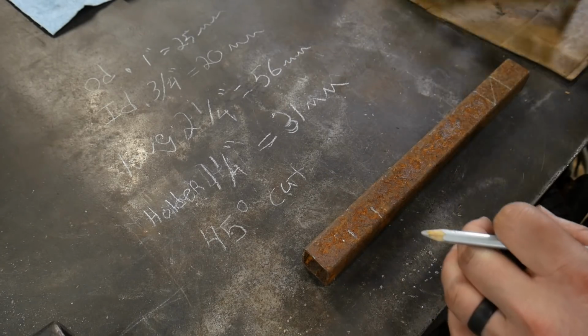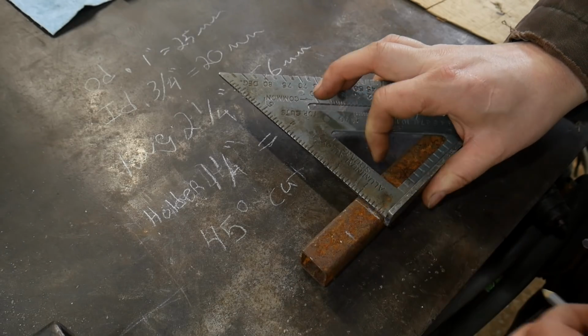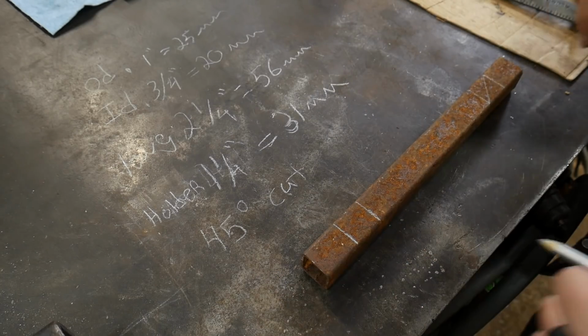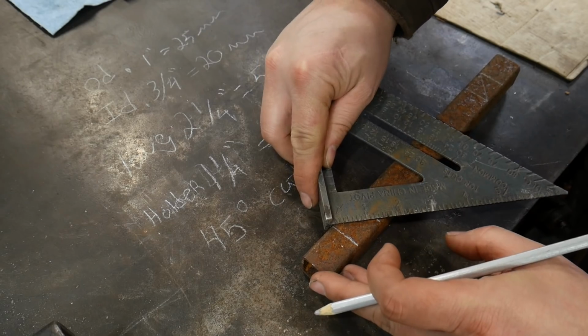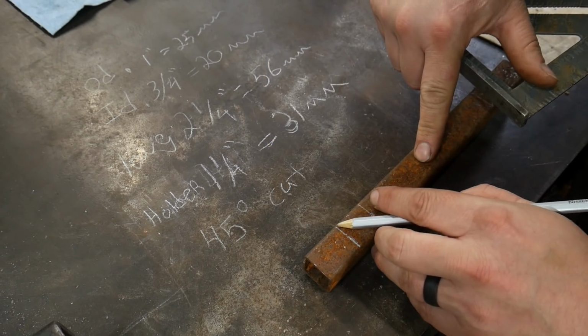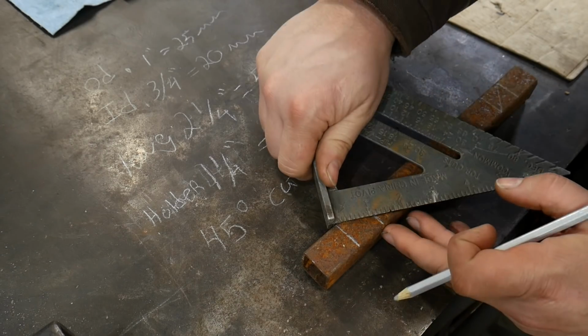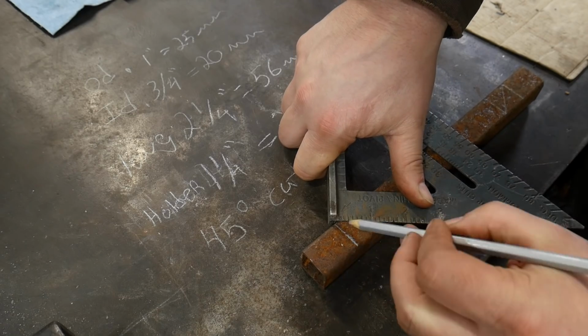After we do that, we're going to use a straight edge of any kind. I like using a speed square for this purpose. I find that it makes it very fast and adequate. And then, again, not much to it other than to do it. Line up the top of your speed square with this portion and then over here. It doesn't really matter which way you go. You're going to cut this off anyhow, so it doesn't matter.